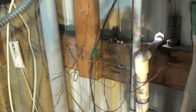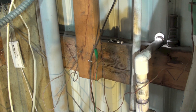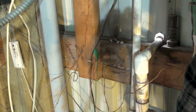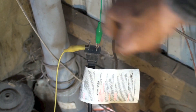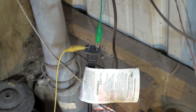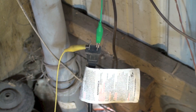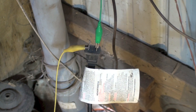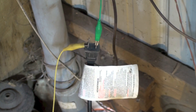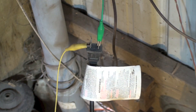Here I'm at the other end of this circuit I've made up. I have a very large earth ground here that goes down about six or seven feet and I've hooked it up through my setup here. This yellow wire is coming from my 120-volt power source - an electric car that has usually 125 volts on it, but it's completely isolated from any other voltage. I've taken one side of it - this yellow wire goes out to the car and has a direct connection to one side of the line. The other side goes to the ground rod.